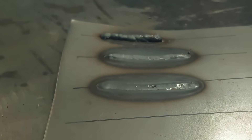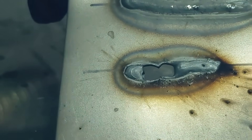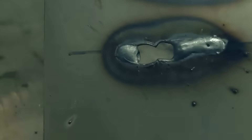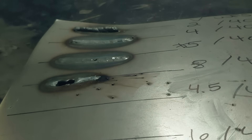Let's see what happens when you have too much voltage. Increasing the voltage immediately made the weld pool get out of hand — it blew through. When the voltage is too high you start getting excessive spatter. I don't think we need to go up to 10.